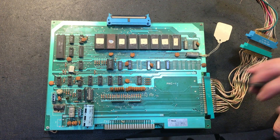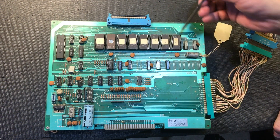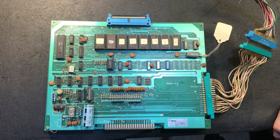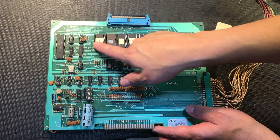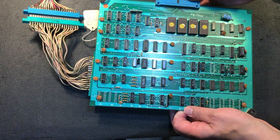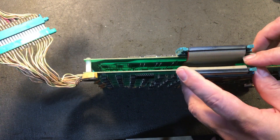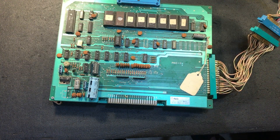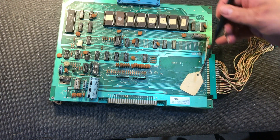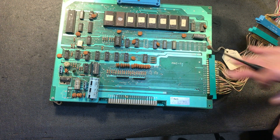Here's yet another version - as you can see it says Pack One. I'll put a link in the description to where you can find more information on identifying each of these boards. This one is a two-board stack, which is quite interesting. We've got eight 2716s across the front for the program code, and on the back we've got the character ROMs which are also 2716s - so again the character ROMs are split over four. The two boards connect with a ribbon cable which will probably die at some point. Interestingly, this board has two edge connectors: a 22-pin and an 18-pin.